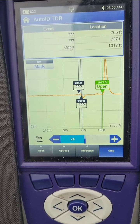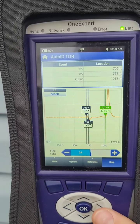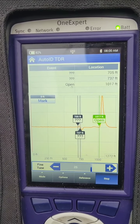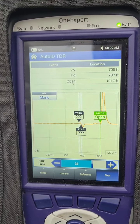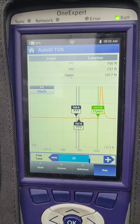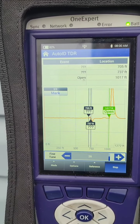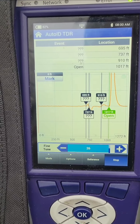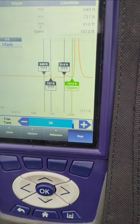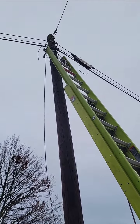Opening at a thousand. We'll zoom in a little bit. There's something at 700 — it might just be a short little terminal bridge tap connection. I'm not worried about that, but we're going to want to trace that thousand-foot open, so I'm going to put tone on and then go hunting. I didn't quite make it 0.2 down the road, but look what I found.